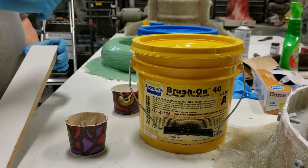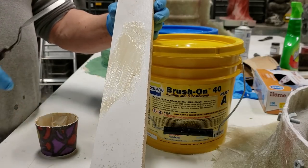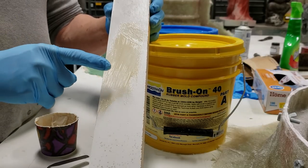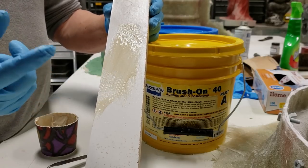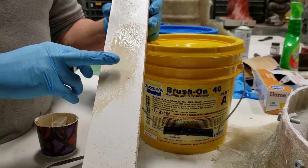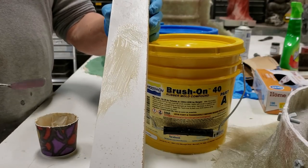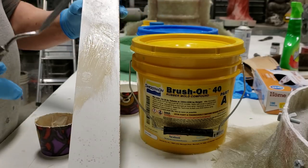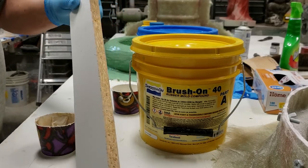For the second coat - here's the trick: you've got about 20 minutes pot life, then it's going to sit on the model for about 20 minutes to half an hour. You're going to come back and it has to be tacky but not pull off the model. If you touch it with your finger and it pulls off onto your finger or off the model, it's not ready yet. But if it's sticky and doesn't come off on your finger and stays on the model, then it's time to go. If you let it cure too long you'll get delamination, so you have to be on the ball - you can't leave the house or put another coat on tomorrow, it's a one-day sort of thing.